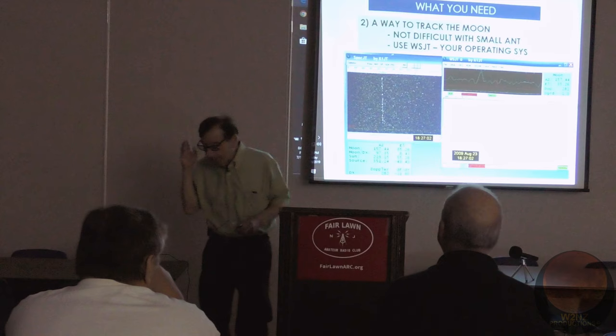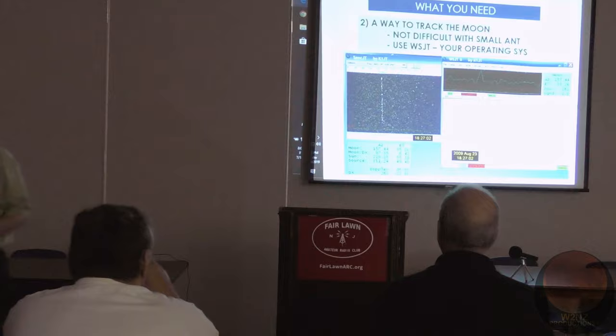How accurate is the element supposed to be with a Yagi at 3 centimeters? Around a few millimeters? Accuracy. Oh, the accuracy. You can figure that I would say you want to be within about 5%, okay? It depends on the Yagi design you have. Some are more sensitive, and you want to be careful. I would say about 5%. Some might say 2% of the length of the Yagi elements.